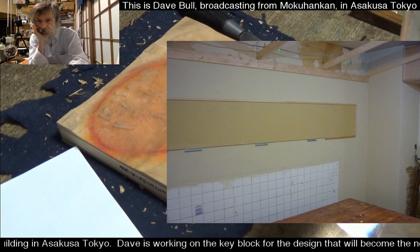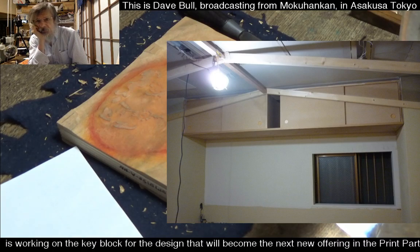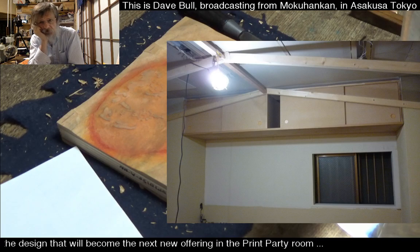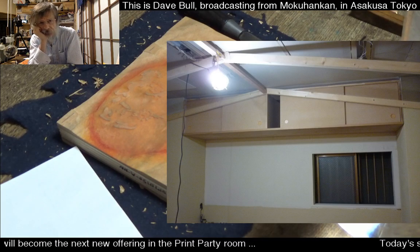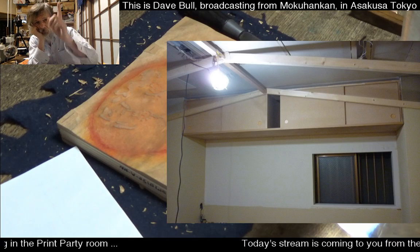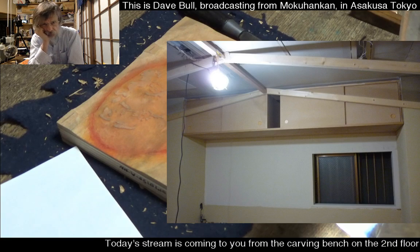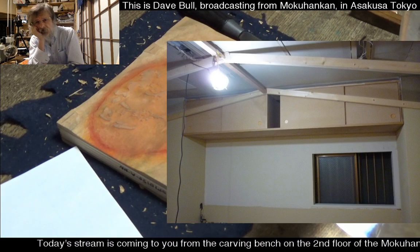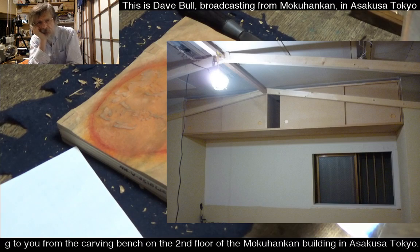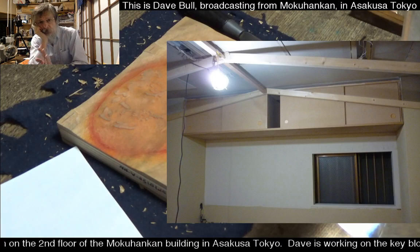And the reason I show this, look at the ceiling. I guess maybe we can see it. Here we are. The original ceiling is some kind of funky asbestos burn-proof tile from when it was a kitchen, and we can't touch that. We can't take it out because it's too hazardous, and we can't hang a new ceiling because we would have to go through the asbestos-hung ceiling to get to the concrete. It's absolutely impossible to touch it. Now, it's not dangerous as it is, but we can't start drilling it and mucking around and removing asbestos panels. It's just not possible. So what we're doing is we are burying it.